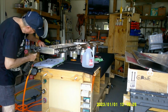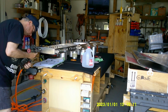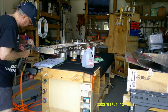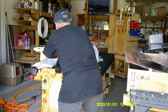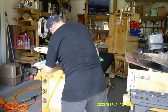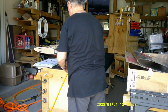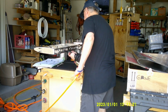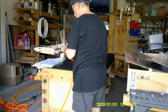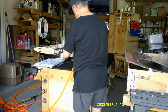All right, well, here we go. Putting in a rivet on the side piece, as you can see, because I Clecoed above and below, put in the rivet, and then I put a couple rivets in the back piece there, and then I'll come back and take out the Clecos and fully rivet that. And so here you'll see me starting to rivet all of these pieces actually into place. And then I think this is either the third or the fourth time those have been actually in place.